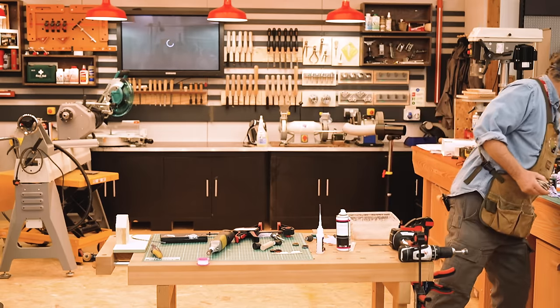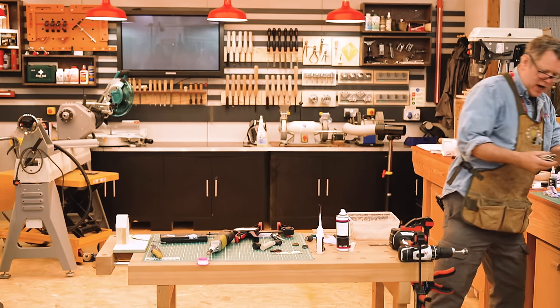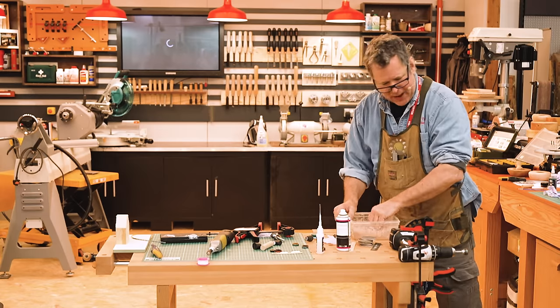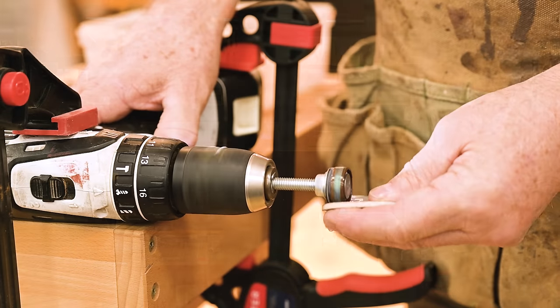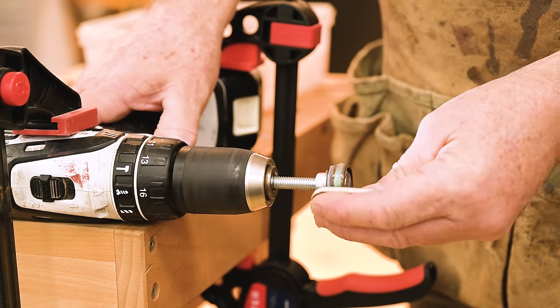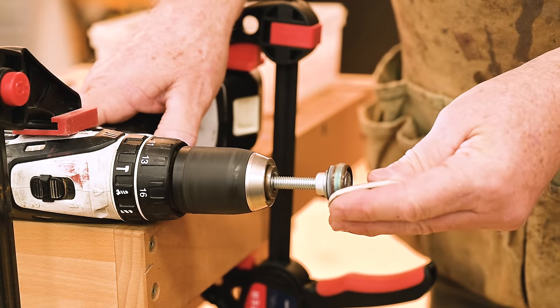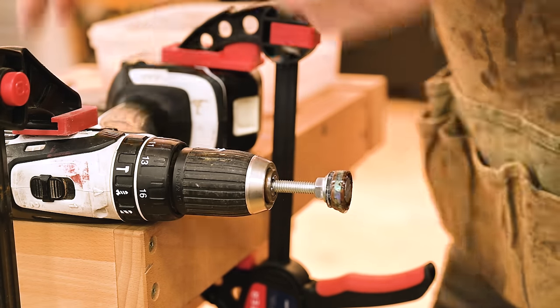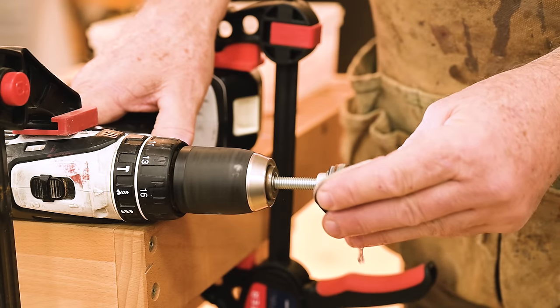But these are used for wet sanding. And this really takes it to a much, much higher level. I'm not going to do all of this, but again, the wet zone here, so bear with me. So again, you're just going to go through each grit, rinsing a couple times, and so on and so forth, working my way all the way up. This will give you a much finer polish.